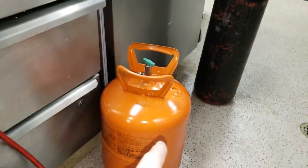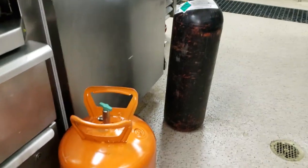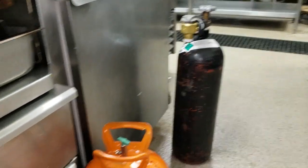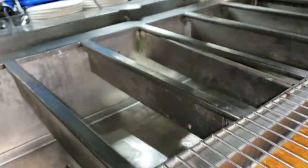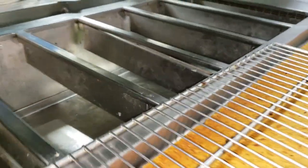What we're going to do is put a tracer of 404 and then top it with about 200 psi of nitrogen, and we're going to find this leak. I have a very strong feeling it's going to be up in this cold rail.